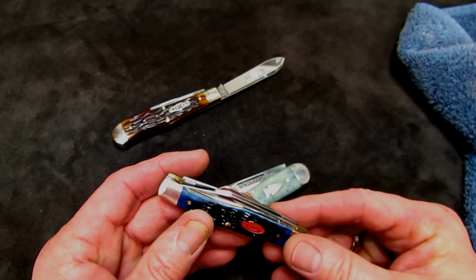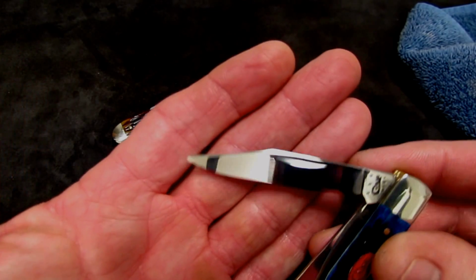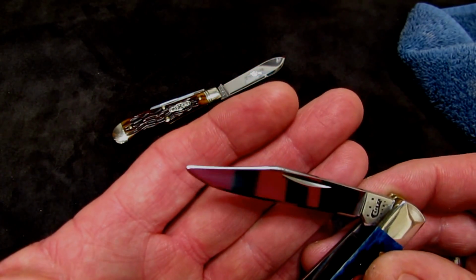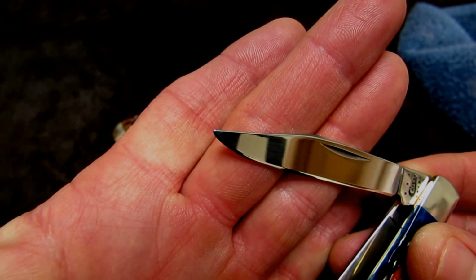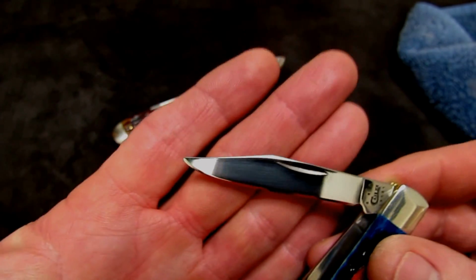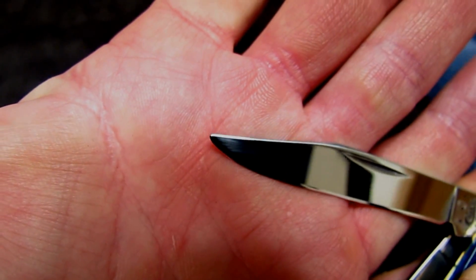Walnut shells were used extensively, I think, in the early 2000s. And because this process happens prior to putting the edge on, but after finished grinding, you end up with these round tips, which I just hate. I can't stand a clip point blade with a round tip. It just makes no sense to me. That needs to be a needle.